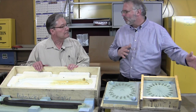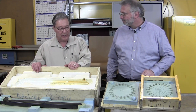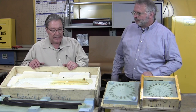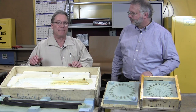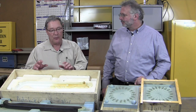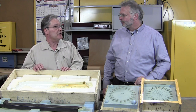This takes you from the math model all the way through the SLA, through your mold, to the finished tool. This tool is good for probably over a hundred parts, and the fiberglass side considerably more. Getting the air out of the tools is always important — that's a real art, and the mold maker determines where to vent parts. This process has been around for quite some time, but it still has a niche that works very well. Depending on your application, keep this in mind — it may be the way you want to go. Right material for the right parts.